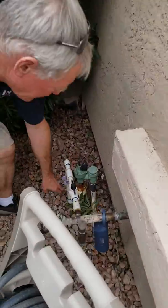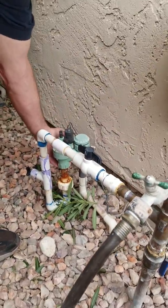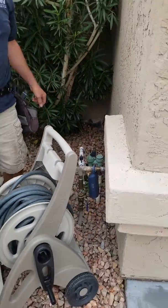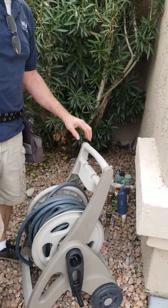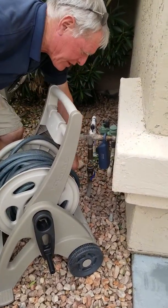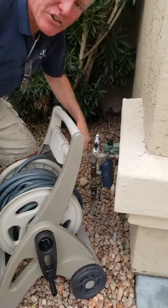You can see down on those valves there's a whole bunch of rust. On the back side it was damp here when I first got here, so you've got to get that checked to make sure it's not leaking. We'll get your water shutoff for the house — one-inch copper, 70 pounds water pressure.